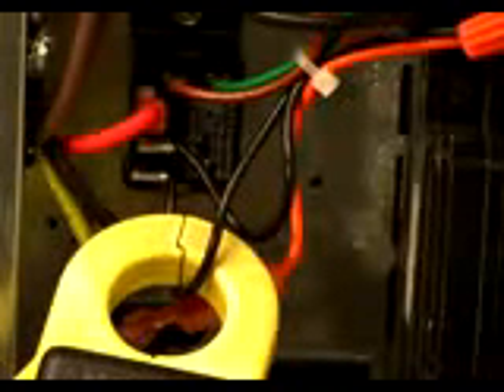I've got the clamp meter around that lower wire feed in that lower terminal, which is normally closed to the contact, so it's closed when the relay is not energized. And if we look at the amp meter, we see that's where our voltage or current is coming from — through that normally closed side. So that tells us it's got to be coming off on a sequencer.